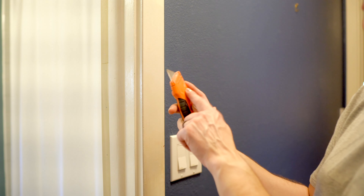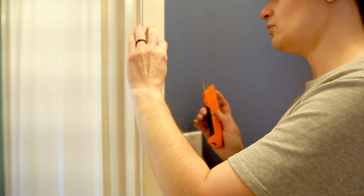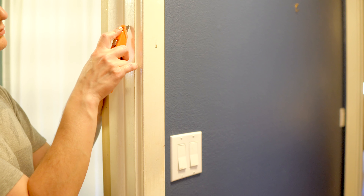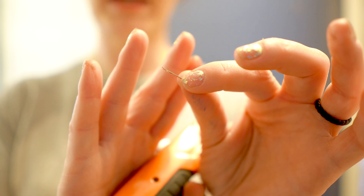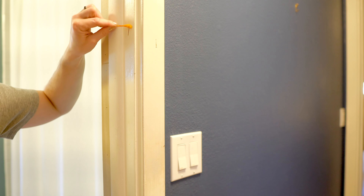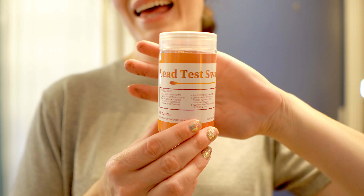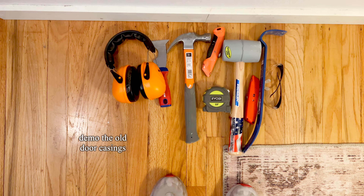Super simple — all you do is take a utility knife and cut diagonally, making sure to get all the way down to the wood grain and exposing what may be layers of paint. I'm going to do that again here on this trim that I do plan to remove. One thing I'm noticing right away is we're not dealing with lots of layers of paint here, which is a great sign. Now we're going to take the swab — I just wetted it — rub it on the area for 30 seconds. We're looking for any pink or red pigment. The swab is still goldenrod in color, so we can assume no lead is present. You can get lead testing strips at your local hardware store; I'll link them in the description.